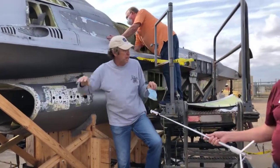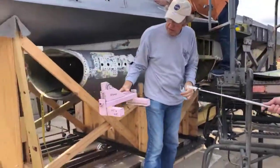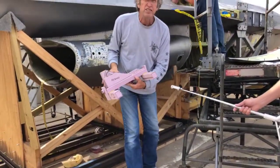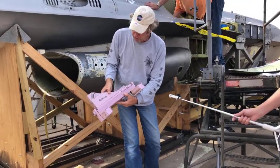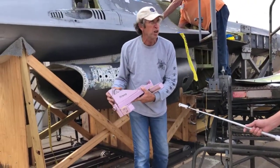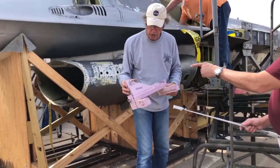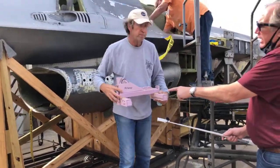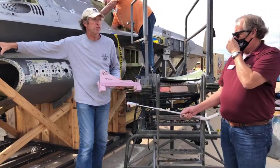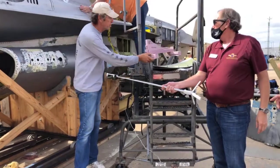Here's the model Smitty worked up — showing how that thing would go up and down and side to side. We did this first on styrofoam in the garage and then turned it into steel work. From the model, we built the superstructure. We custom-built the superstructure in place, measured everything where it was sitting, built it in the concrete, and built this roller frame. We welded nuts on there and ran bolts in that jacked this thing up and down.